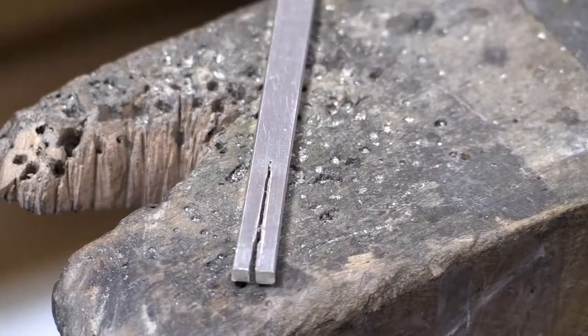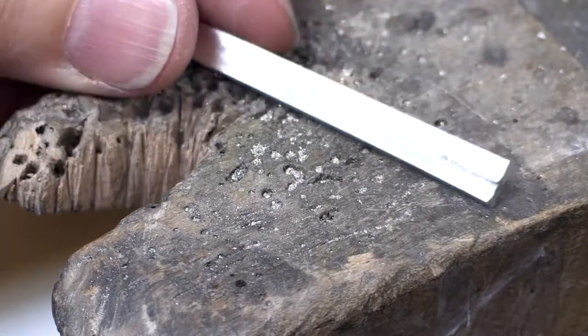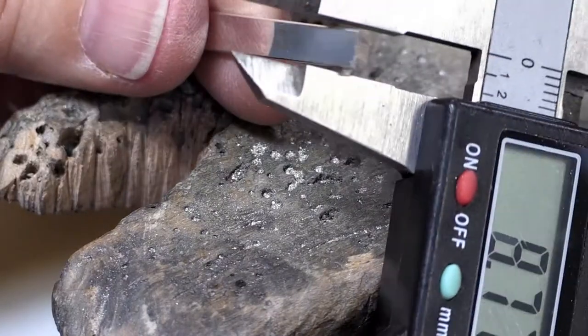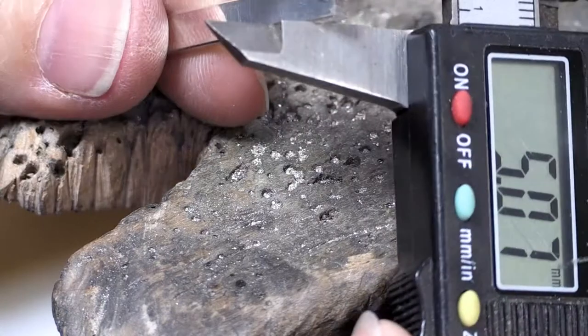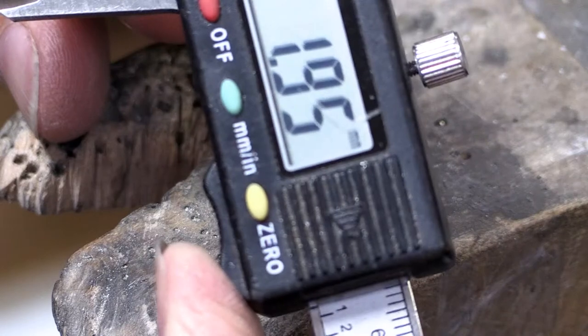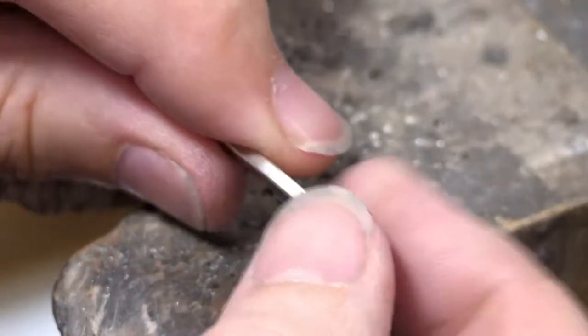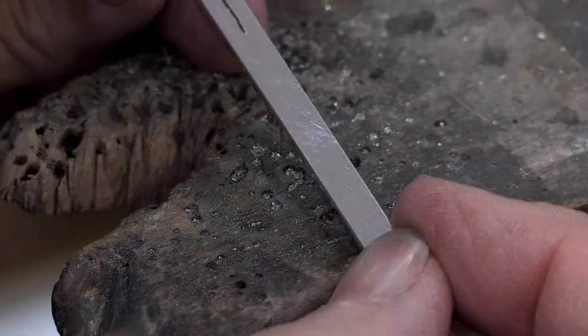Here's a piece of sterling silver - it's a nice piece of shank material. There's no rule about it but I wouldn't go under maybe a millimeter and a half on the thickness. This is about five millimeters wide by 1.9, almost two millimeters thick - that's a very sturdy ring. Silver is soft, so if you use a one millimeter shank you're going to have a ring that could misshape.